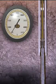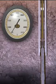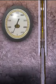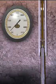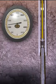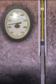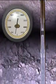The pump down plug follows the cement down hole, wiping the drill pipe and separating the cement from the displacing fluid. As the pump down plug nears the calculated displacement to the liner wiper plug, the pumping rate is reduced. A pressure increase may be seen when the pump down plug latches into the liner wiper plug, and the plugs will shear off of the running tool assembly.